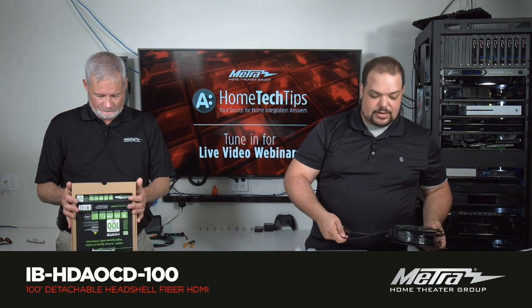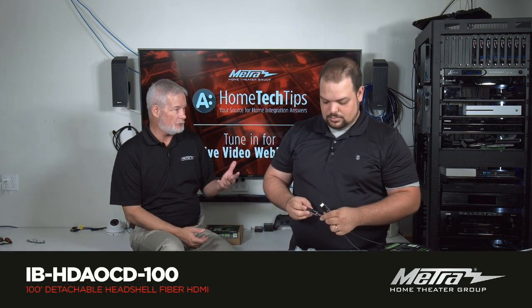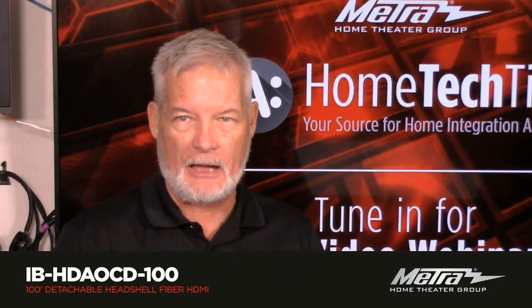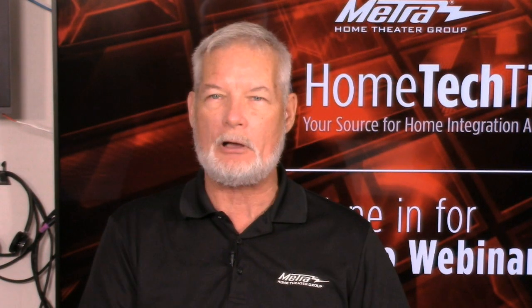So Brent, other than what we talked about before, what is the other benefit to fiber versus copper? Well, the biggest advantage of fiber is purely distance, because you don't have the loss, you don't have the collapse of the eye pattern over the distance. Now, when you look at an AOC cable, whether it's a permanently attached head shell or the detachable head shell like this, the vast majority of them are what we call a hybrid. What this means is the TMDS, or the video feeds, will be in fiber. There are 4 of those. The EDID, HDCP, voltage, hot plug, all those signals are carried over copper.